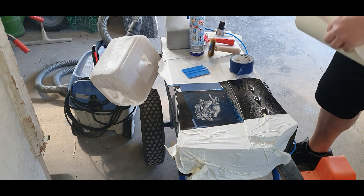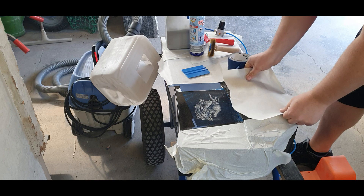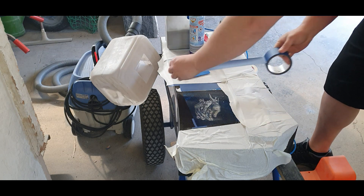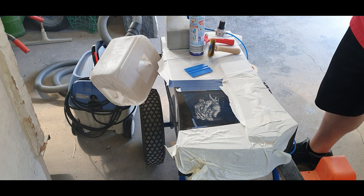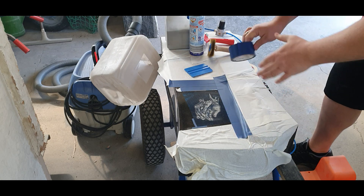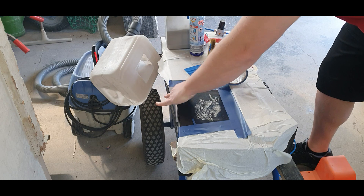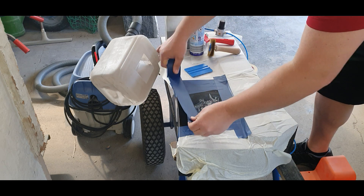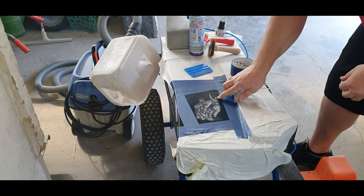I don't want to mess up the stone — you really don't want to mess up the stone even if it's pre-engraved. I'm using a self-stick paper and a PVC tape. For the pen blaster I'm using later on, the nozzle size is 3.2 millimeter and the abrasive as I mentioned is aluminum oxide 150 mesh.